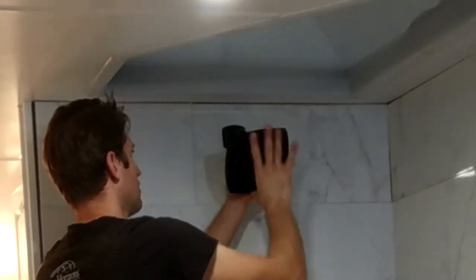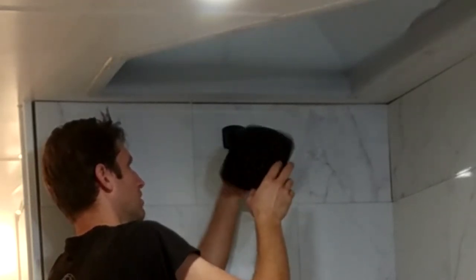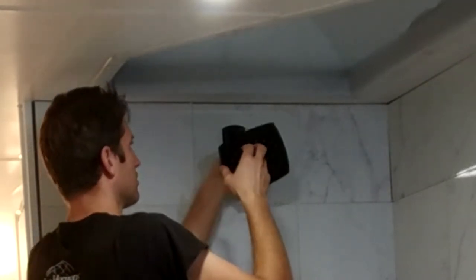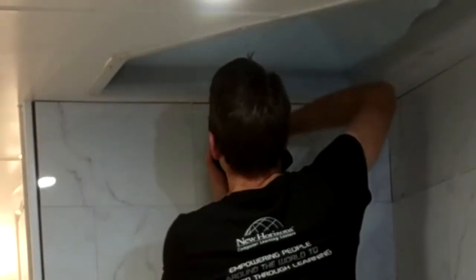After you screw it on and test it out, you can see if it holds water or if it's going to leak at that joint. If it does leak, then you can remove it and apply more. Try not to use pliers with teeth on this as you could scratch the surface while you tighten it up, ruining the finish of your shower head. Use a wrench instead if needed.